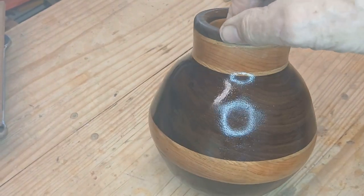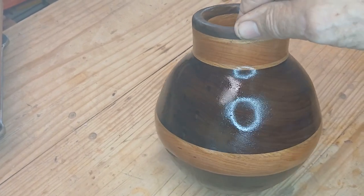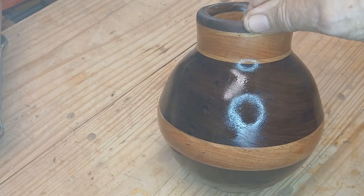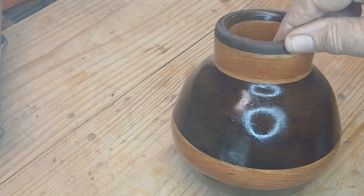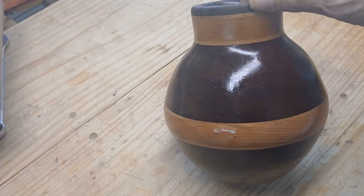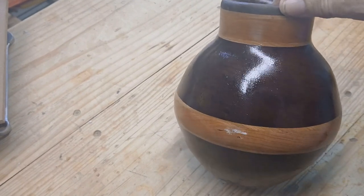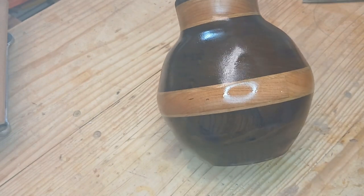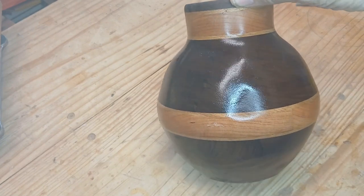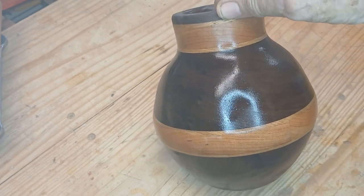Well, there it is. As you can see, it's still shiny — it hadn't completely soaked in. The mineral spirits will dry off and leave a really thin coat. I'll sand it very lightly and apply multiple coats that way. This shows how well the walnut shows up. I really like the way the walnut's looking. The cherry did darken some and there's more contrast than before the finish — still not as much as I'd like, but there's some contrast between the little veneer layers on either side of it.